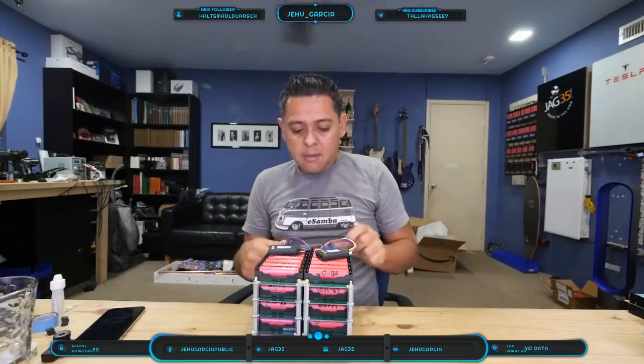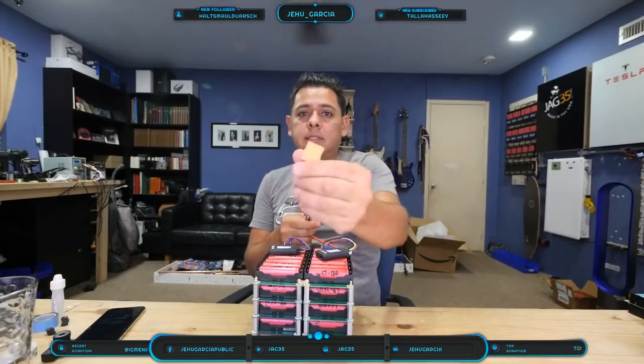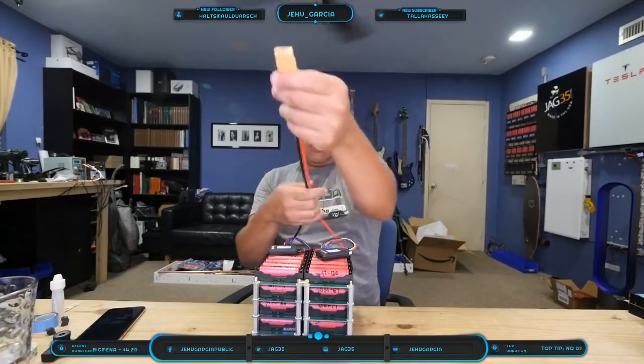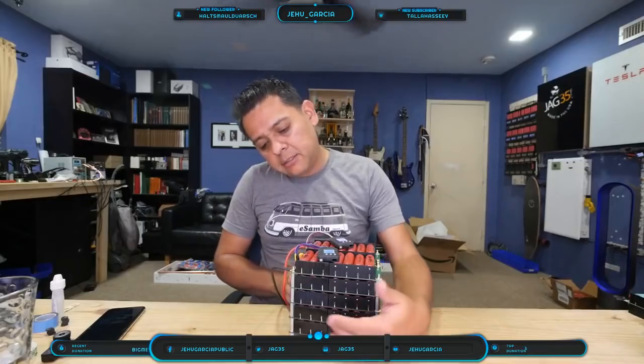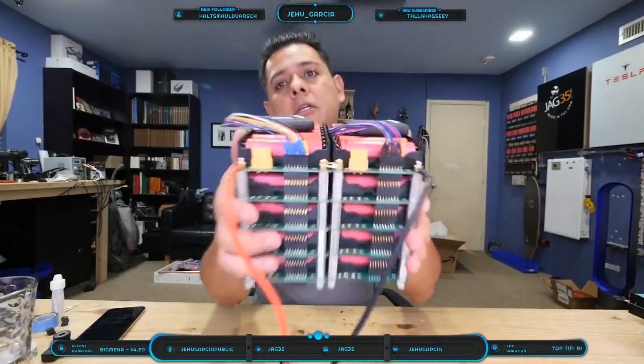I was thinking of doing that earlier in the builds. I thought I was gonna do 6S, but then I thought, what am I doing with these? I just gotta go as high as I can in the voltage. And it was a good thing because now the skateboards are pretty good at 10S. But there you go. There's the 14S one, which would work with this pack, by the way. You could just connect that charger right here on this XT90. Oh yeah, by the way, guys, I'm not using the XT60 connectors here. All I did was bridge the center thing there.